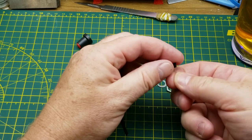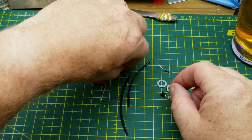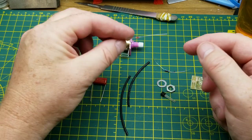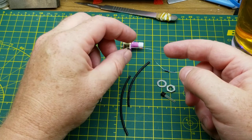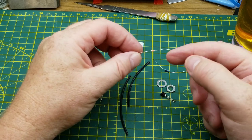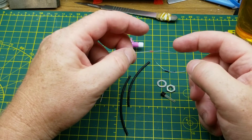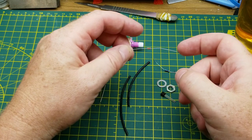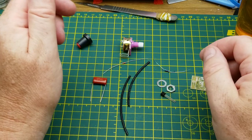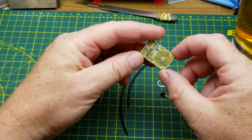We have a small 600 milliamp capability triac. And we have a dual diode, aka a diac, which is the most specialty component in this whole thing. And even that you could replace with two diodes back-to-back, or two zeners back-to-back, or even an NPN transistor if you chose, if you didn't use the base, just cut the base right off and just go collector to emitter, because they do have a breakover voltage. And that's it. A couple bits of wire, knob, and the circuit board.